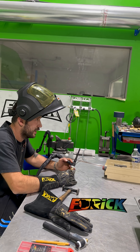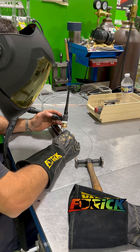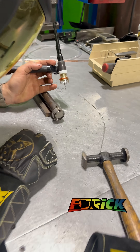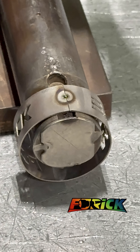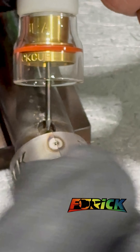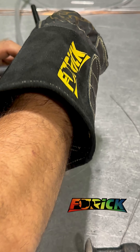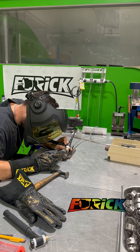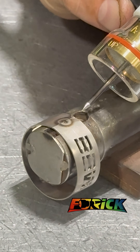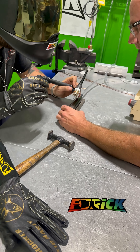Do you arc start directly on the edge? No, do the middle first — get the middle intact. Then arc start each edge. When you start an edge, come at the face of it and move it a little bit back and forth to get them formed together. If it opens up a keyhole you're going to have to use a little rock. New machines will blow the edge right off. Now do the other side.